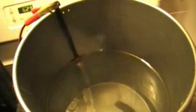We're going to leave this in here — I'm going to let it cook for probably overnight, give it a good 10 hours, and see where it's at. I've got it on 2 amps. That shows you guys what to mix in there and how many gallons to use — and you too could make your own electrolysis tank. A 5-gallon bucket is fine for what I'm doing. I've got a lot of iron I need to clean up and I just wanted to show you guys how to set up electrolysis. I'll get back with you after this sets, we'll pull it out and let you see what it looks like. Then I'll do another video on wax treatment on your iron objects.